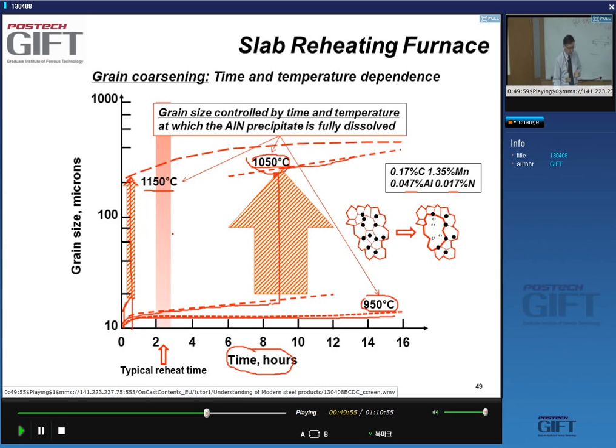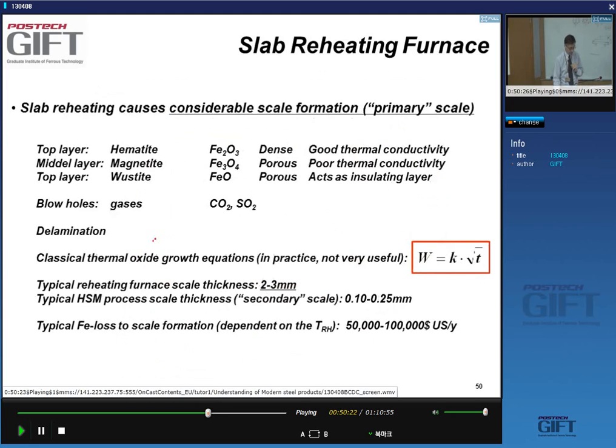So the typical residence time of a slab in a reheating furnace, as I told you, is about 2.5 hours. So you can see that in that case, we will very quickly and fully dissolve the aluminum nitride. Good. So that's what happens at the level of microstructure, with very big grains unless you've added titanium nitride